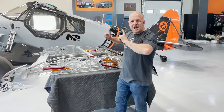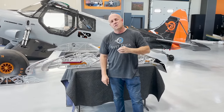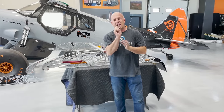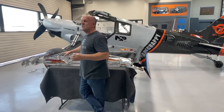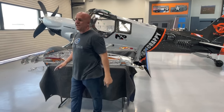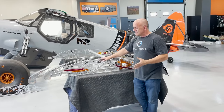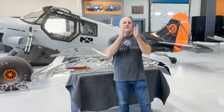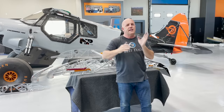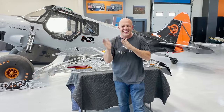The torque tube runs the entire length of the wing. Every single component is machine matched, bearing set, and then embedded inside a bearing racetrack with side rails. All the bearings on every track are good to 30,000 RPM and over 600 pounds of load force, and there's multiple for every section. Two thumbs way, way up for our leading lady. But the more important thing is there's nowhere in here for me to make an adjustment. I didn't want to have five moving components on each wing that someone could turn one turnbuckle in or out and get anything out of sync.